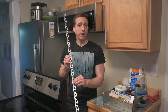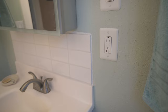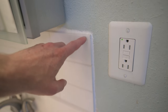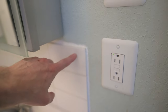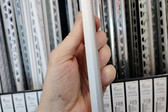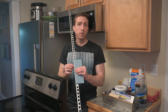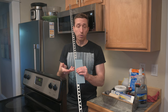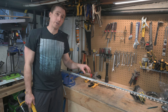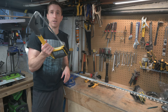If you want a nice clean edge for the area of your tiles, you can get a transition profile like this. I did bathroom tiles previously and I really wish I'd used a metal transition piece for that edge. These come in different materials, colors, and shapes, and allow you to butt your tiles right up to the edge so you wouldn't see the tile adhesive or maybe even some mortar from the side. Whatever material your transition profile is made out of, you'll undoubtedly be able to cut it with just a hacksaw.